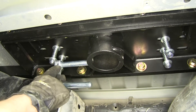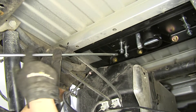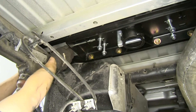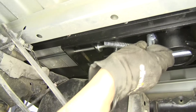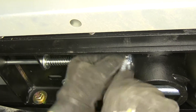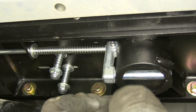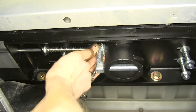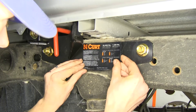Now we'll insert our ball lock with this hole facing towards the top. Now we'll take our handle for our ball release and insert it over our frame through the hole here. We'll slide on our two washers — we may not need all two of them but we're starting with two for now — and we'll slide on our spring. Now we'll take our bolt and insert it through the hole into the handle, making sure it's pinned in place. We'll place the nut on the other side, then use a 5/16 wrench and a 9/32 wrench to tighten down the lock nut. Now we'll go ahead and place our sticker on our driver's side frame bracket.